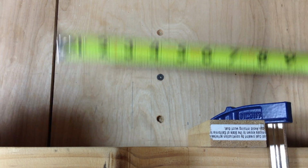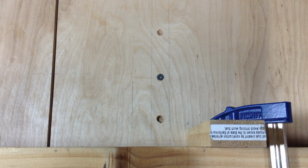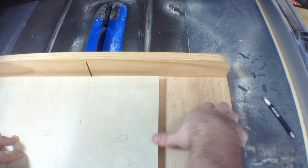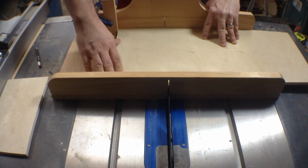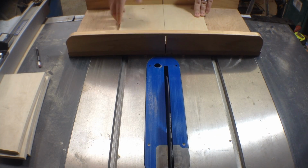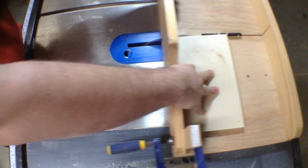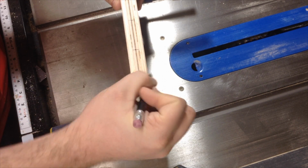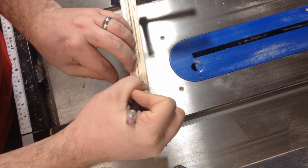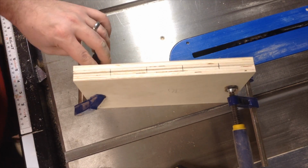First, I start by cutting 4 6-inch pieces of 1/2-inch plywood on the table saw sled. Now I'm going to cross cut 2 of them to 9 inches long and the other 2 to 10 inches long. I'm planning on storing 5 different grits in this when it's done, so I'm taking the 10-inch pieces, I've clamped them together, and I'm marking out 2-inch pieces to cut dados.